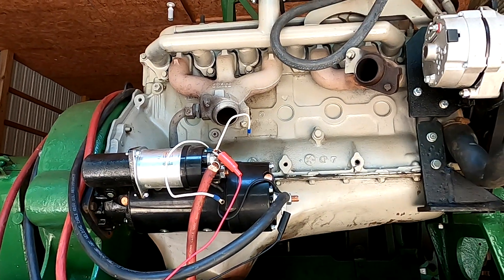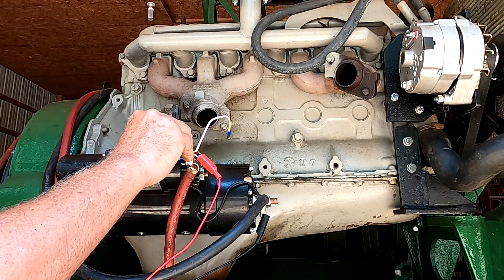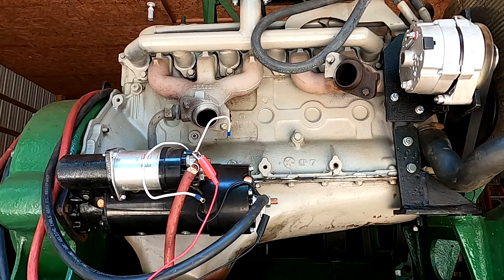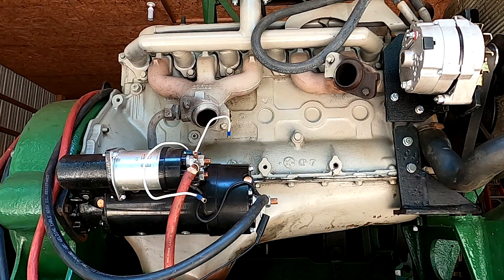You can see behind me I have the engine put in this 10B. We put it in late yesterday evening. We got it started and checked the master clutch — it's engaging but not disengaging very well. We looked at some of the drums, they're turning, and we just kind of played with it a little bit. I'll get ready to start it now and do a little check of everything to see if this thing's going to start.